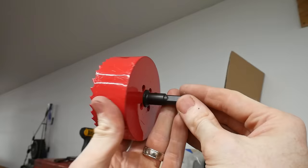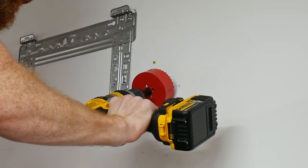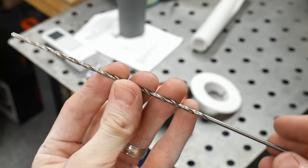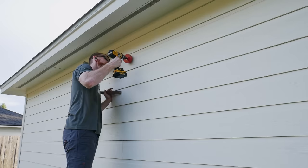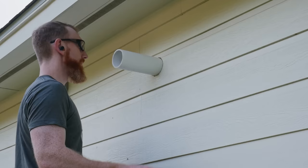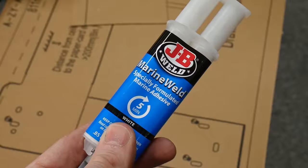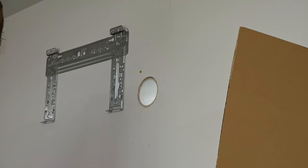The manual recommended a hole around 2 and 3/4 inches, but reviews online recommended going larger, so I drilled a 3 and a half inch hole since it fits a standard piece of large conduit perfectly. To transfer this hole onto the outer wall I used a long skinny drill bit that I normally use for drilling tang holes in handles for hand-forged knives. Make sure to angle this hole a few degrees downward to aid in condensate drainage. I pushed a 3.5 inch conduit sleeve through both holes until it was flush on the inside, marked where to cut it on the outside, and then epoxied it in place.